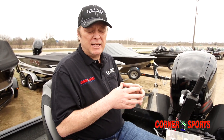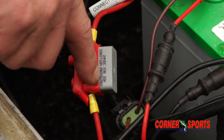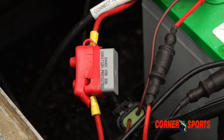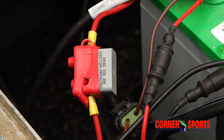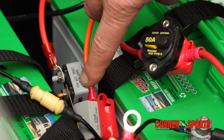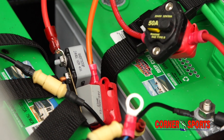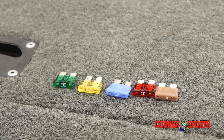Another thing I'd like you to keep in your boat is a circuit breaker. If you look at your main battery, there's a circuit breaker that feeds your main distribution panel to your media center, and there's also one on your trolling motor. I suggest everyone keep at least one spare in their boat, so if they're on a trip up to Canada and it fails on them, it's an easy fix.